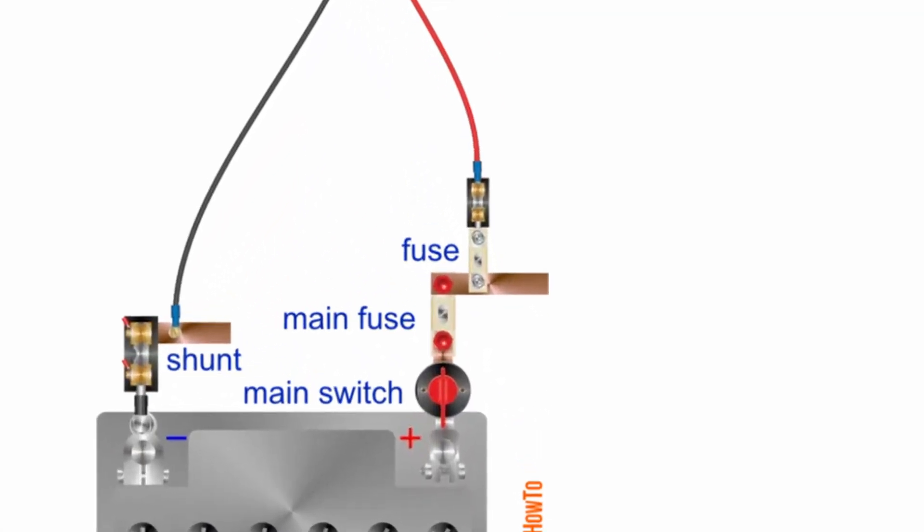The battery, however, can melt the conductor down. So we put the overcurrent protection at the other end of the circuit — at the battery end.